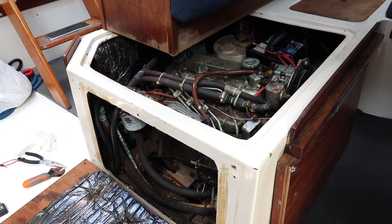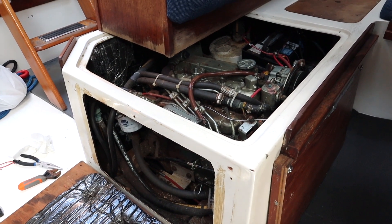When we started the engine, we let it idle for a while to work any residual air through the system before revving up again. We have success. The engine started. We let it idle for a few minutes just to make sure any remaining air would work its way through, and then we revved it up a bit in neutral to get the RPMs up — because that's what was happening when the RPMs increased: the engine would be starved of fuel and turn off. The fuel filter fix seemed to work. It's running well. We talked to our neighbor and they mentioned a similar issue could be caused by build-up within the fuel tank as well, so that will be a project for the future.